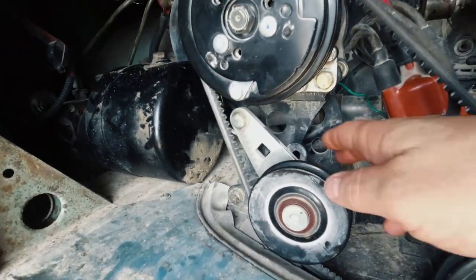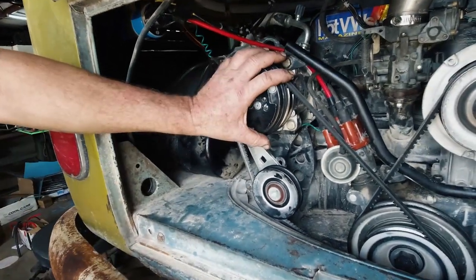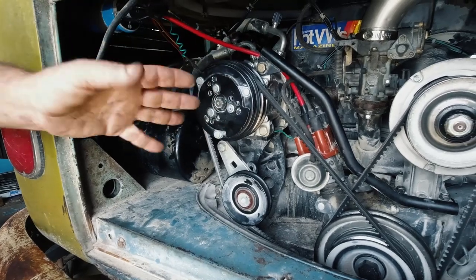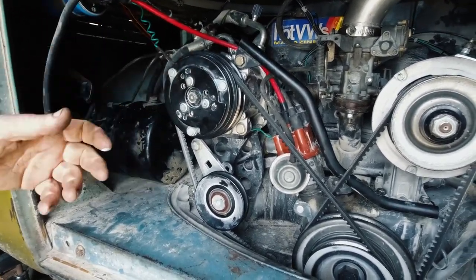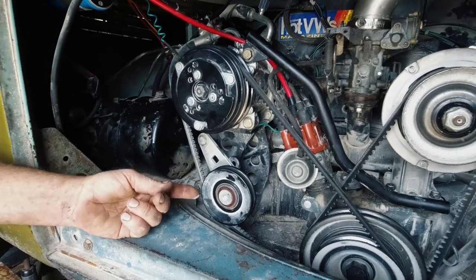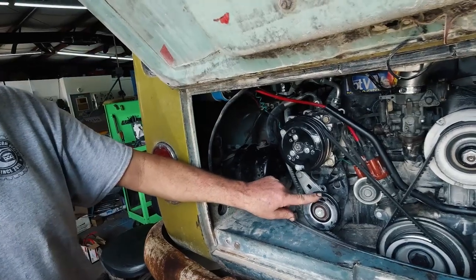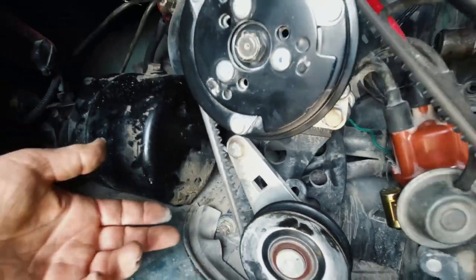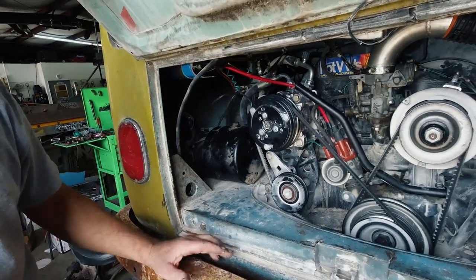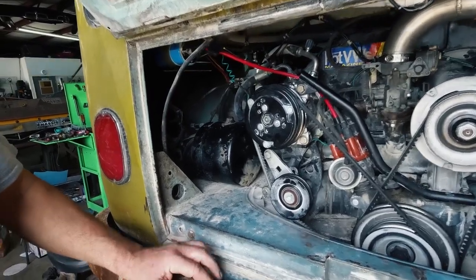Was this just a tensioner you found? Yeah, off of Amazon. I just needed some kind of tensioner because I didn't want to make the whole compressor move. I thought it would be easier to make fixed brackets. I found that tensioner for about $15 — there was Gates and a whole bunch of different brands — so I knew it would be easy to get. It had a bracket on there, so I just had to make this extra little bracket down here and put a belt on it. Super easy.